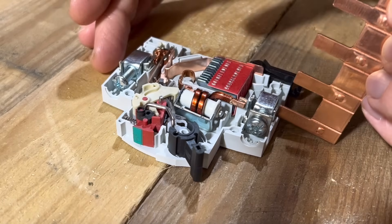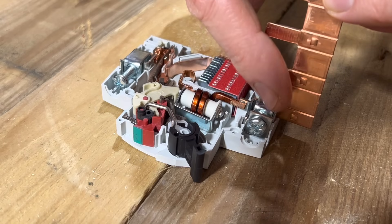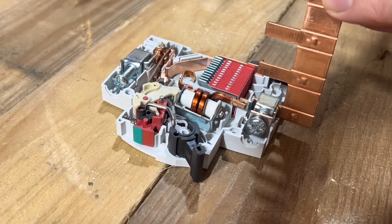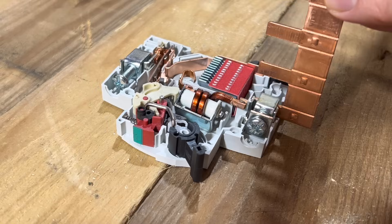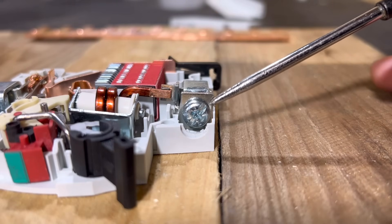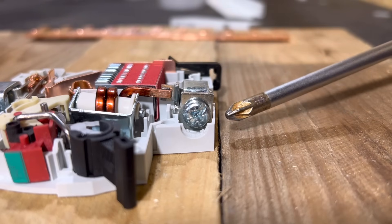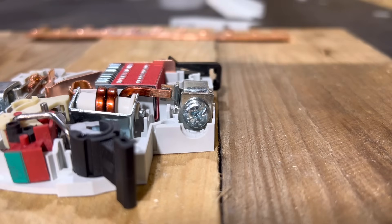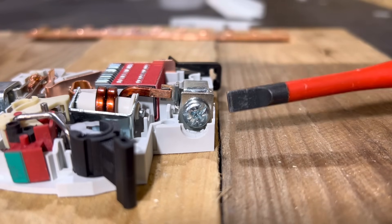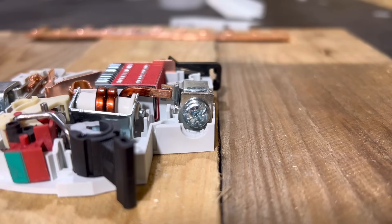For simplicity, let's assume power passes through in the traditional manner — from the busbar to the circuit breaker via this cage terminal. The screw head itself is a bit unusual: it has a combination of two different driver styles. It's half posi, which you can tell by the little extra driving slots in the corners, but it also has a large slot across the front, like a slotted screw head.